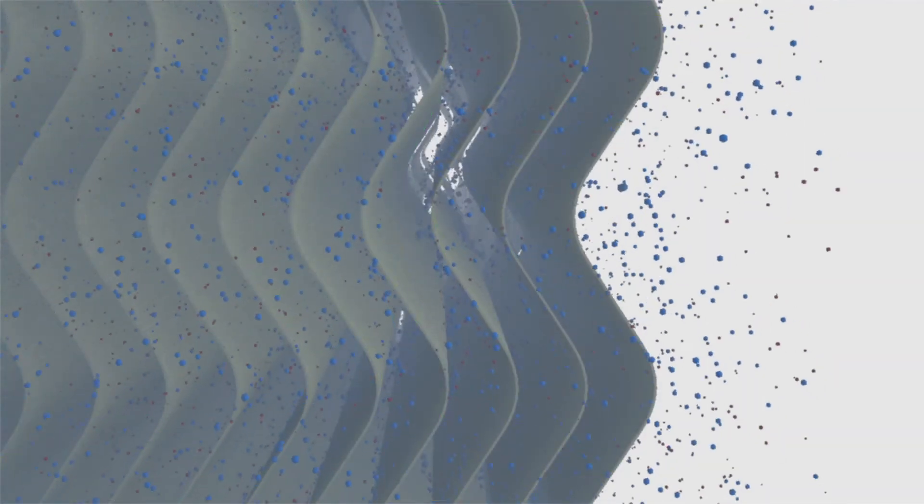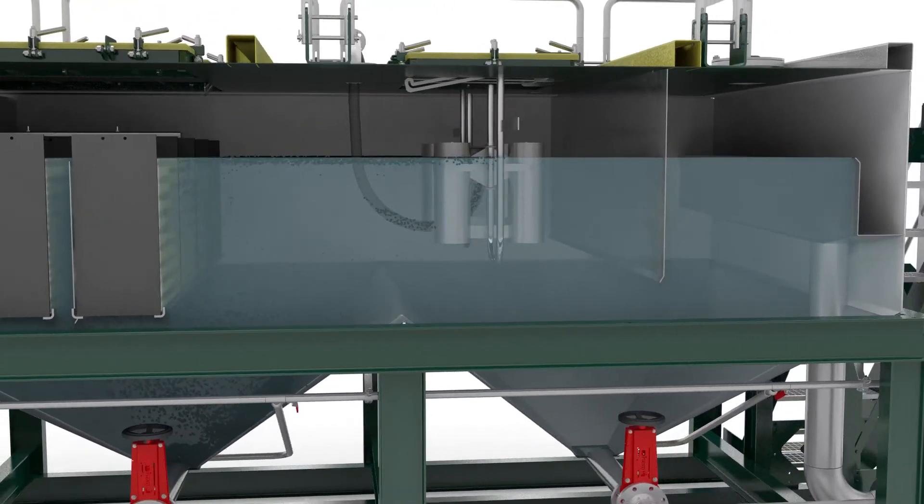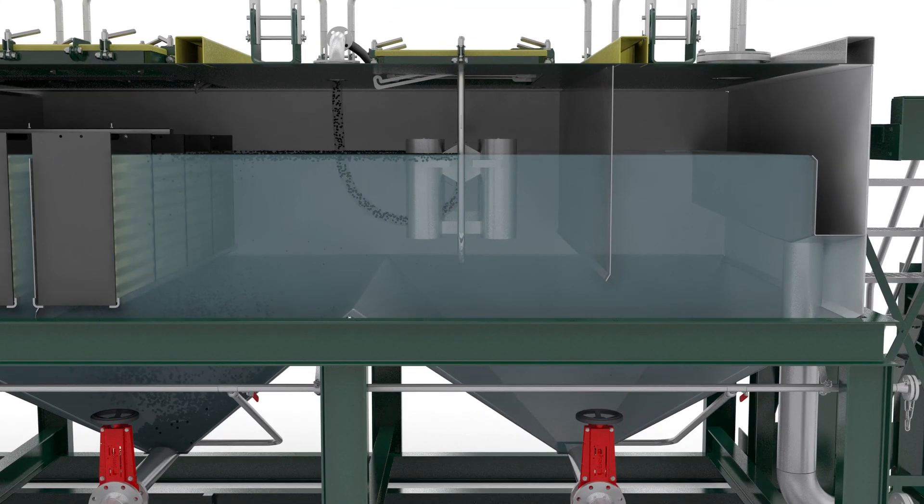Because this increases the separation speed, the majority of the remaining settling pollutants fall into the bottom of the second cone, while the floating pollutants rise to the top. In the third compartment, an underrun blocks the layer of floating pollution, which is easily removed with a skimmer.